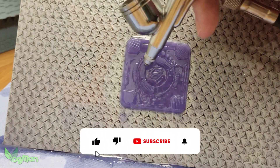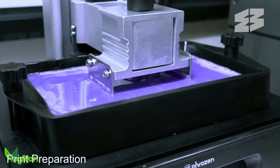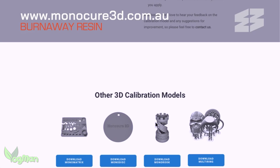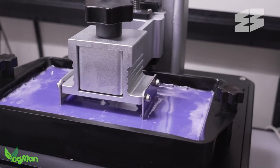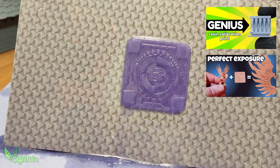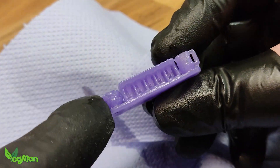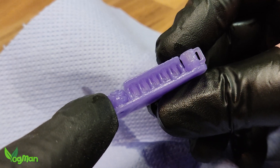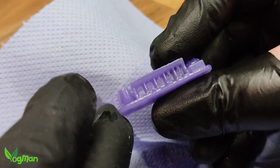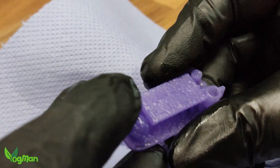Depending on how many layers are in your print, this could significantly reduce print times. The video goes on to state: 'We recommend a calibration model to dial in the 3D printer with the resin. This will improve the success rate and ensure your models are printed with the highest detail as possible.' That's okay — that's what I do with every unknown resin. But here I didn't need to bother. This fast time of 1.6 seconds worked perfectly for me. Genuinely, I wasn't expecting this — I was expecting typical marketing hype. But no, this really is faster than I've seen on any other castable resin. That's truly notable.